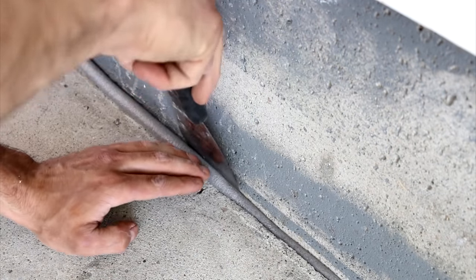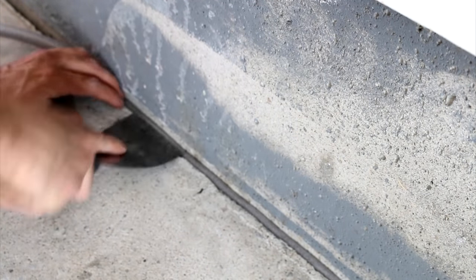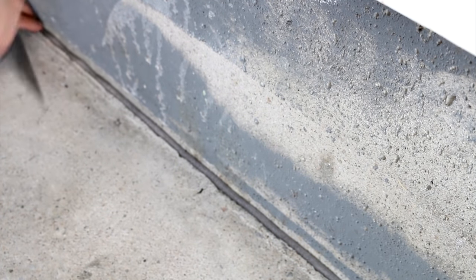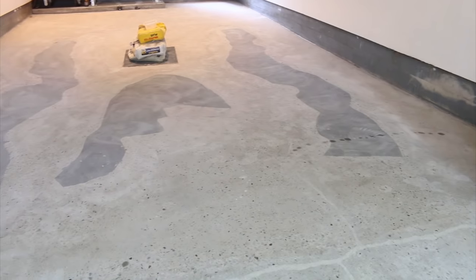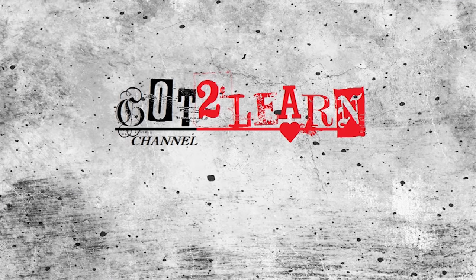You'll be left with a smooth, strong finish ready to get painted. The last thing I did was to install some foam insulation on each side of my slab to prevent bugs from getting in in summer and cold air from getting in in winter. That completes part 4 of the series. All that's left to do is to paint your slab with your favorite color epoxy paint — I'll cover this in part 5. Until the next video, keep building!